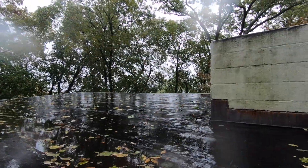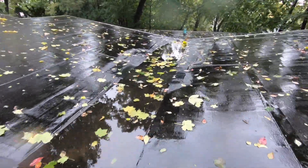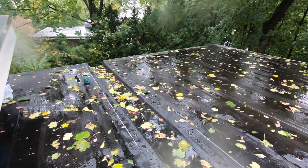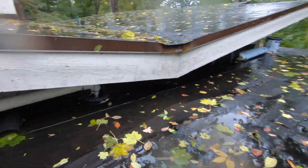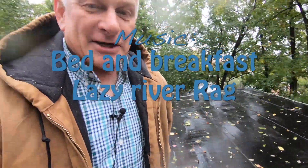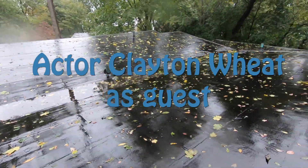I still have to lower the roof more here — you can see water is still pooling quite a bit, and I'm going to have to open this up and make it lower. But look at this — just a little puddle, almost nothing. I'm the flat roof doctor; I know a thing or two because I've seen a thing or two. The scupper is working very nicely.